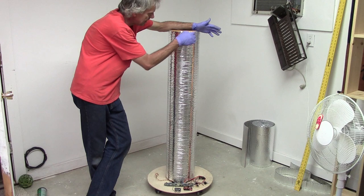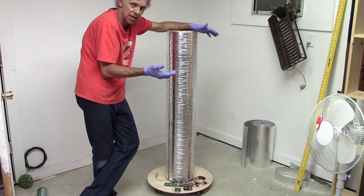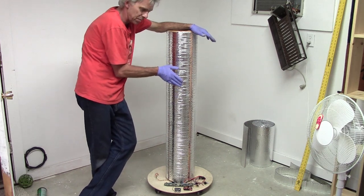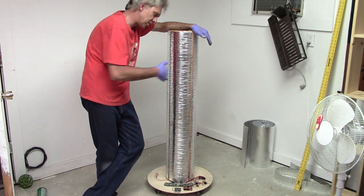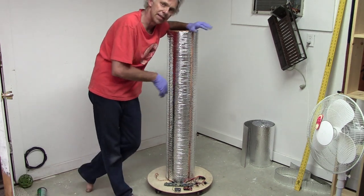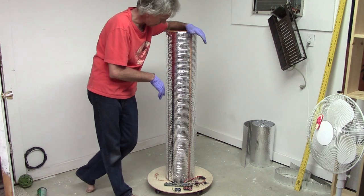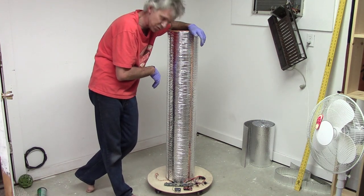And then these four quadrants will line up to four bump switches on the navigation of the robot. So it might bump into something and it'll back up, turn left or right a little bit, and try again. And if it bumps on the side, it'll turn further toward the left. If it bumps on this side, it will turn further toward the right and try again. That's the basic idea of the code with the four bump switches. I've done it on smaller robots. Okay, let's get some screws in this and we'll start stringing this thing up like a musical instrument.